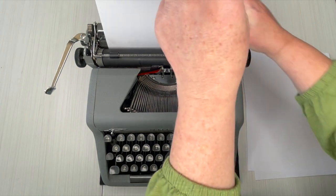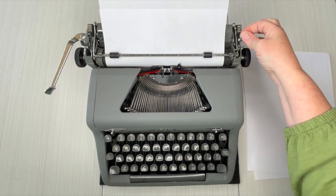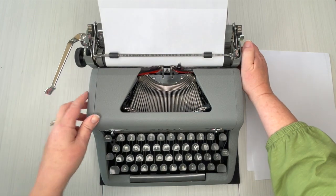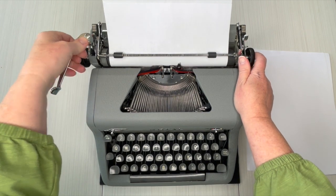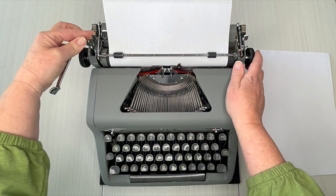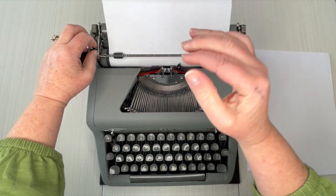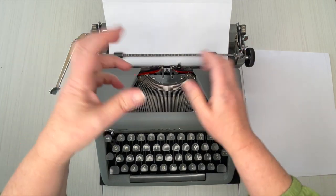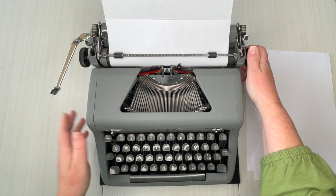Just set the paper right there, turn the handle, make sure the paper goes underneath your bar. If it's uneven, there's a little lever on the right side — pull that forward, you can adjust your paper, then re-engage. On the left side, when you hit the return handle it's going to advance one, two, or three lines — this is your line selector. The lever closer into the paper releases the roller so you can do fine tuning, like superscripts, subscripts, lining up with lined paper, or putting an X in a box. Just pull it forward, but make sure you re-engage otherwise it's not going to advance properly.